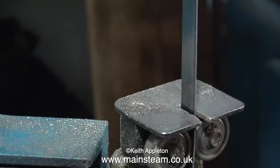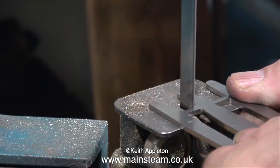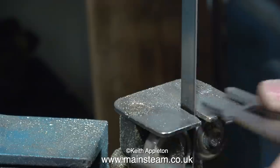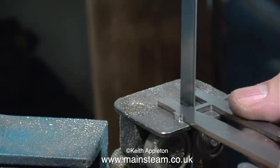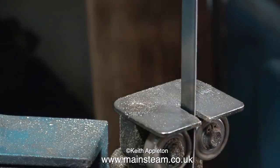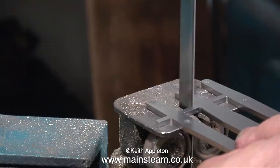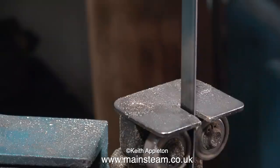The alternative to cutting out these laser-cut parts is really long-winded. It would entail chopping up three pieces of a half-inch bar to the right length, putting them in the machine vice clamp together, milling them to shape, and then turning the ends — not to mention the big clean-up operation removing the milling marks. I suppose I could make them out of wood, but wood underneath a steam locomotive where there's a fire and an ash pan is never really a good idea. I did consider it for about a millisecond, and then thought: don't be silly.